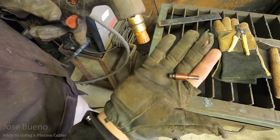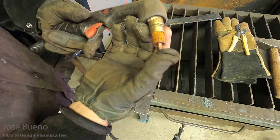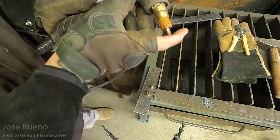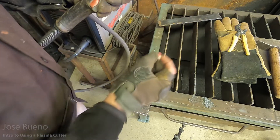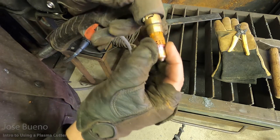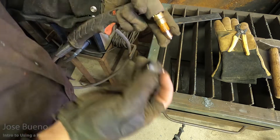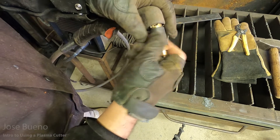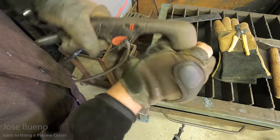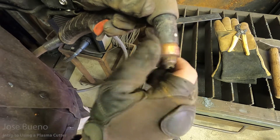The next part is going to be the electrode. With this particular plasma torch, the swirl ring goes on first, then the electrode. The next part that goes on is the tip — some people call this the contact tip, some people call it the cutting tip, but in general this is just called the tip. Once you've got all of that on there, make sure to hold it in place so your pieces don't start coming apart. Then you're going to slip the retaining cup over that, and the retaining cup screws into the torch, which basically holds everything together.